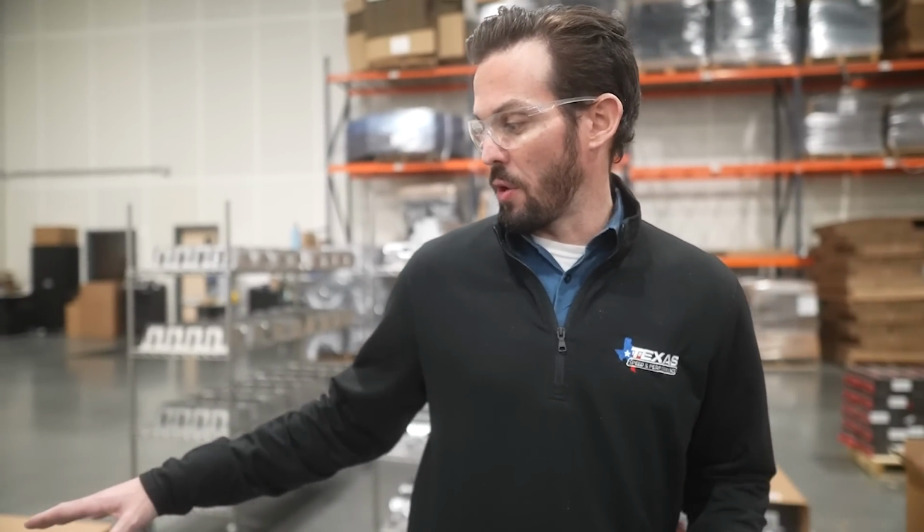What we're trying to do with the in-stock Brawler series cylinder heads, or shelf stock, is have that same premise: you can call in, you need a 220, it's ready to go. You're not going to wait on it to be manufactured, you're not going to wait on machine time. And if you want a short block turned into a long block, we're going to have everything ready. So you go from a 4 to 5 week lead time start to finish to we can ship you a long block in a matter of a few days.